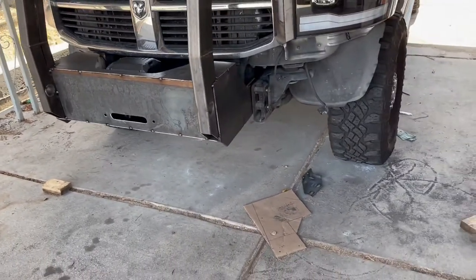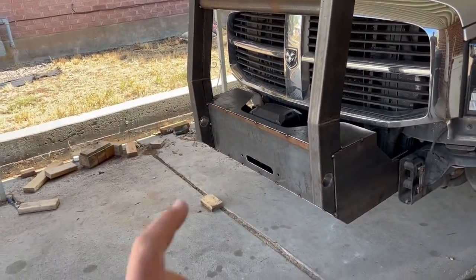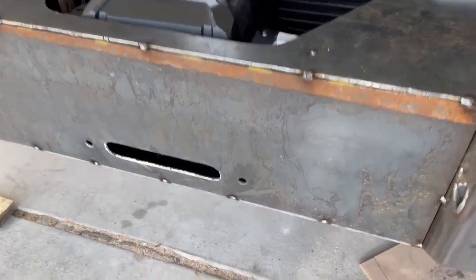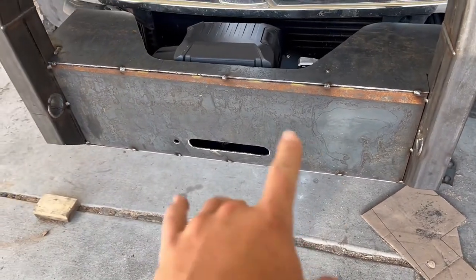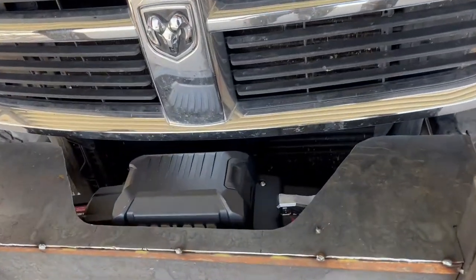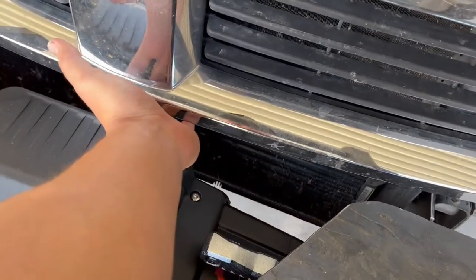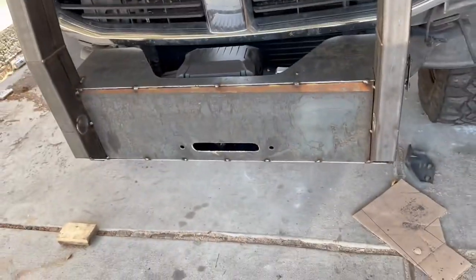All right, so it is a new day, and I was able to make lots of progress busting out that box yesterday, all due to having a plasma cutter, right? I'm just so happy to not be cutting steel plate with an angle grinder anymore. So I was able to plasma cut out my winch fairlead mount there, and then I was able to draw out this top plate with what I thought was a good looking design. Lets you get into the winch handle, and also the hood release latch is right in there, so that's good access to let you get in there.